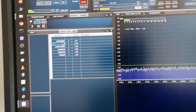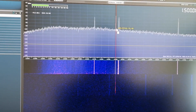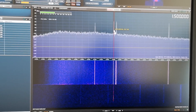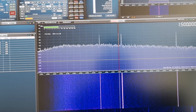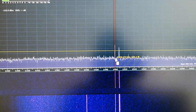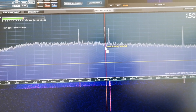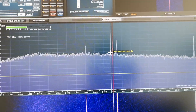Going down to 1.5 megahertz in the broadcast band, on the mini whip there's a medium wave broadcast signal with quite a healthy signal-to-noise ratio. There's another one there - this is a German station and I am in Germany. If I switch to the long wire, nothing. Switching to the loop, actually there's a little bit of something - it picks up a bit of signal with much lower noise since the loop is nowhere near resonant at 1.5 megahertz. The active antenna is definitely the best here.